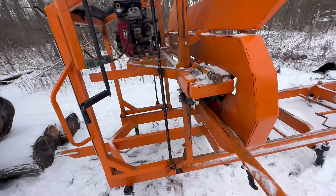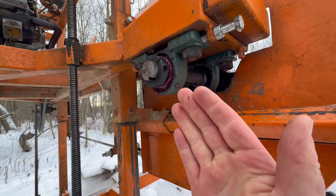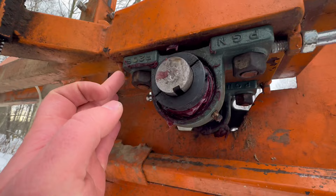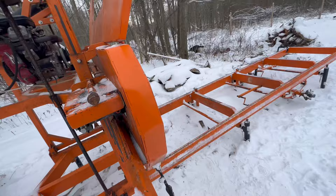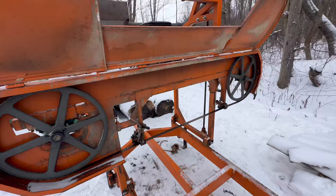To get the adjustment on my pulleys to keep the blade from falling off, these pillow blocks have oval holes and I just put nuts on there. You play around with them to get those axles lined up. It actually wasn't as bad as I thought — I haven't thrown a blade yet, so I'm doing something right.